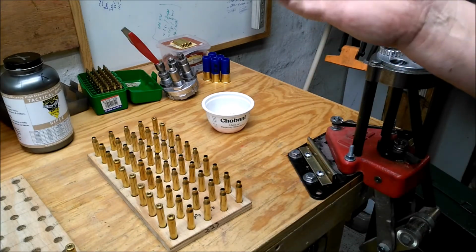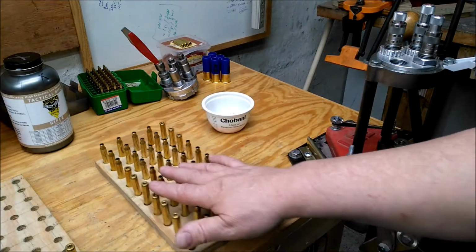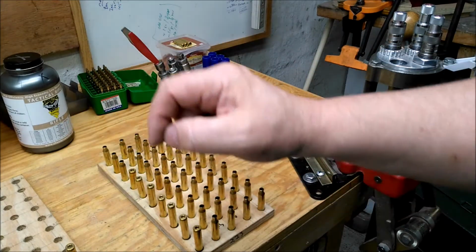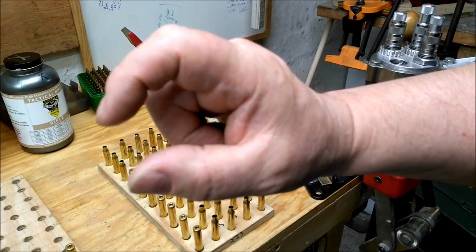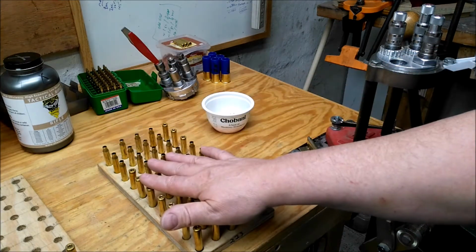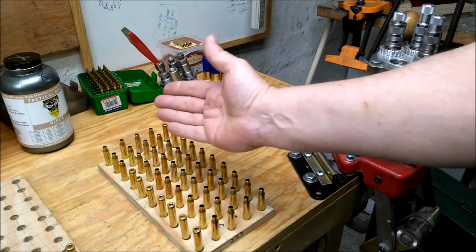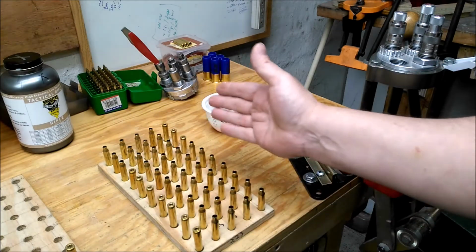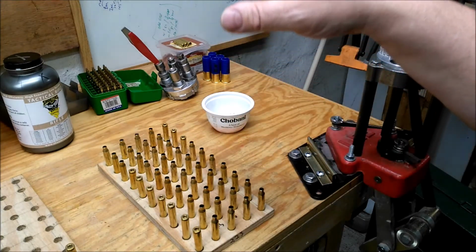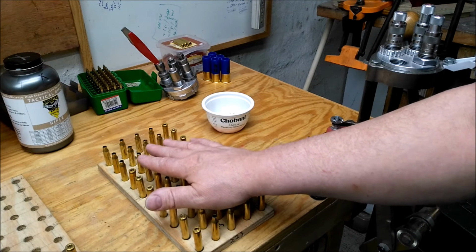Well, I'm thinking even like the plastic molded ones. You get a Forstner bit that fits that molding, get that center, and drill a 1/4 inch through, because they're a bit thicker. I think it would even work in those. The wooden ones, chances are they're done with a Forstner bit. The acrylic ones, I don't know. Some of those are CNC'd, and some of them are drilled with a Forstner bit. But yeah, it's something simple, and it has really helped me out a lot. Saved me a lot of time.